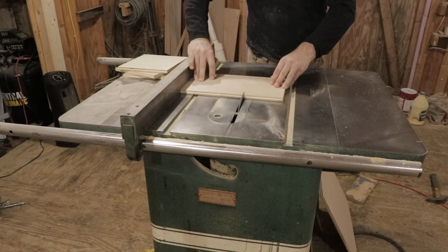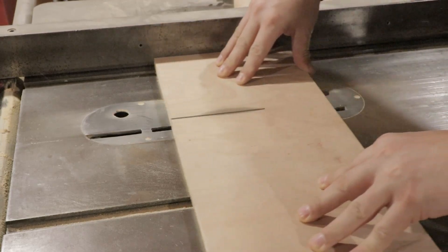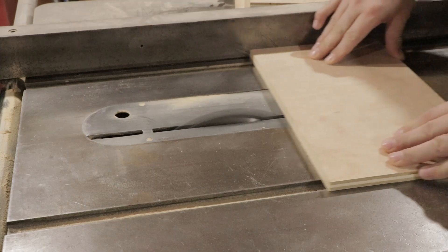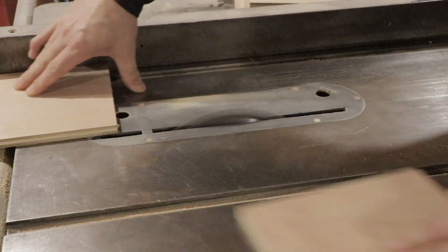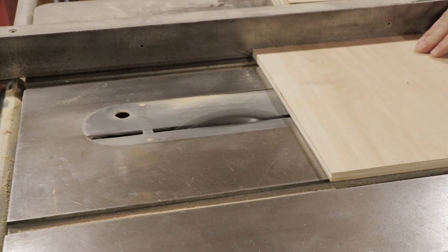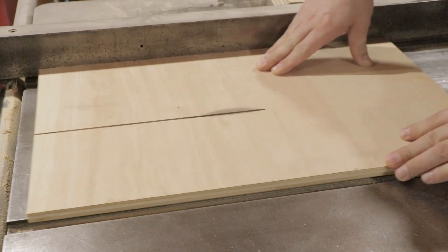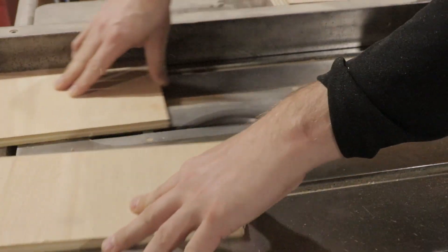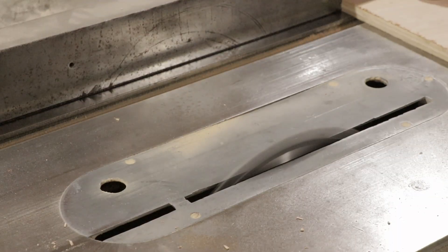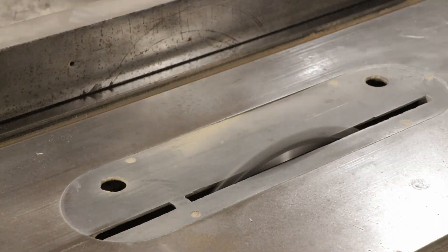There's a link to my website — you can just go ahead and follow the directions if you want to make it. This was a hard one to come up with. I wanted something really small that would work on a desktop, and that's really what we did with this. We paired it with two ND140 passive radiators — links to every part we use are in the description as well. It really came out really well. Tunes it to about 50 hertz, works perfectly for a desktop build or maybe a small bedroom.